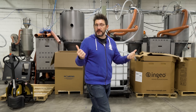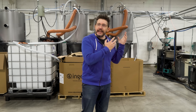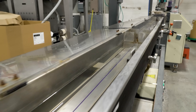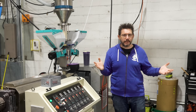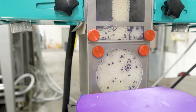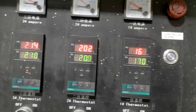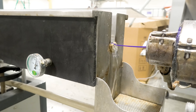Here at Printed Solid, they're also making the filament. You can see the raw materials behind me. Those pellets are first cleaned and then dried, and then using these tubes right here, sent over to these machines to be extruded. The raw material comes in right here and down to this device. These containers on either side contain something called the master batch for the color. Colorant is added at a certain percentage, and you can see the raw material and color combine right here before it goes into this heater, which heats at different temperatures in order to get the filament at the proper squishiness to extrude.